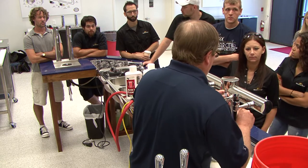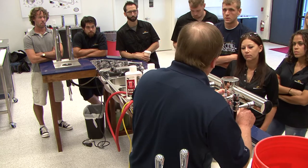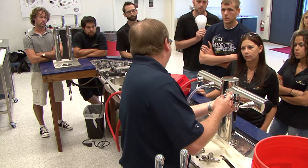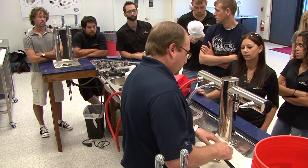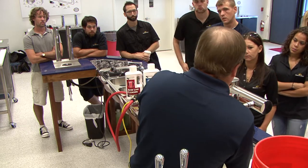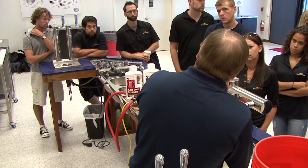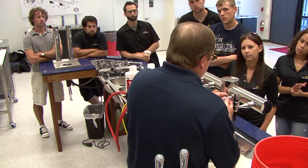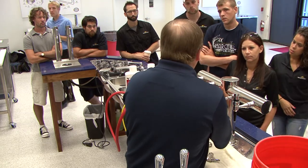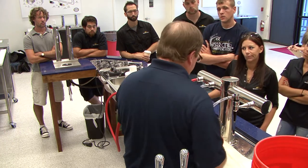What would you do for the max on a short run? It really depends on footage. If you're, let's say, 10 feet of line, a good rule of thumb is I would never go over 12. Because you really need to get that rapid turbulent flow of at least a gallon a minute. So you're going to have to turn the machine up more and more.